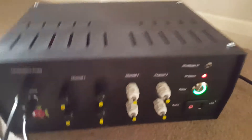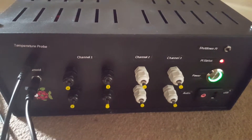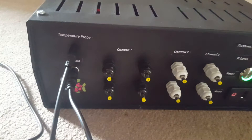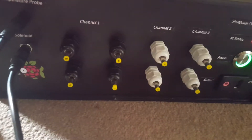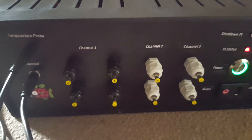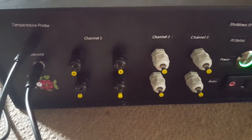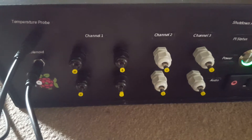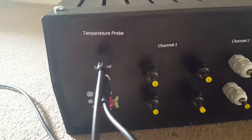I've actually got the Pi hatted on top of all my boards, so it's easy for me to just recreate the boards and swap them out. I've got some nice little labels. We've got three channels of PWM, each of which can be controlled independently, and they all work — two of them are on hardware PWM and one is on software, which doesn't seem to cause any problems. The temperature probe plugs in there and that seems to work nicely.